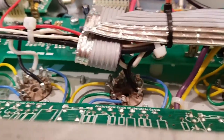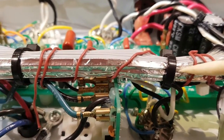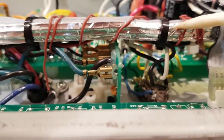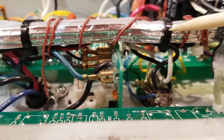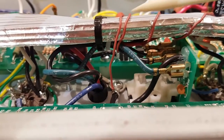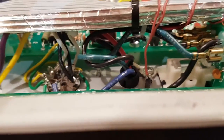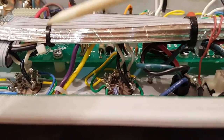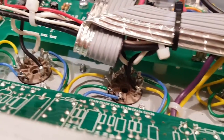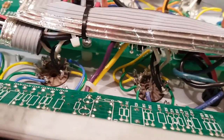This served to reduce a lot of hum as well. Since it's aluminum tape, it's not easy to work with, so I had to connect a grounding wire. I've got to solder that for a nice solid connection — maybe make some kind of brass plate to slip in underneath and tie it with a cable tie to hold a grounding strap in position. I've secured the aluminum tape to the wire loom bundle running up top so there's no shorting to components below. Right now, this is about as good as it's going to get.